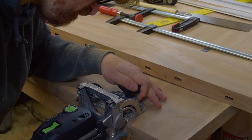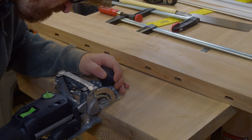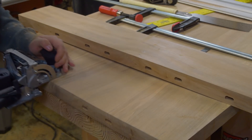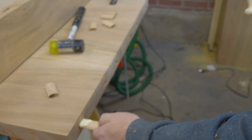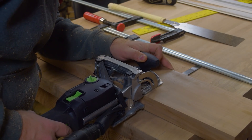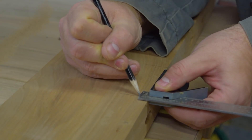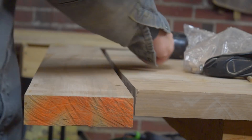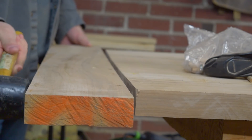I've released a full video on how to do classic breadboard ends — I'll link to that here. But Festool was nice enough to send me one of their dominoes for a future hand tool shootout, and I took the opportunity to try what I like to call cheater breadboard ends. What you do is use floating tenons instead of integrated tenons. You install the biggest domino you can, add a little bit wider slot on the breadboard end so that it has room for expansion and contraction of the surface. You'll mark and drill holes at the center of where each domino will be in the edge of the breadboard end — the first hole goes all the way through. From there you temporarily attach your breadboard end so you can mark the holes that go into those floating tenons you've previously installed.